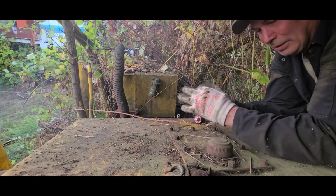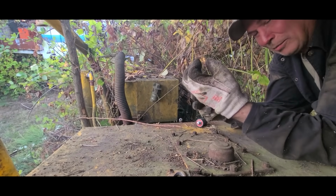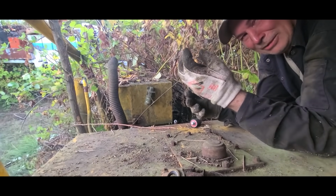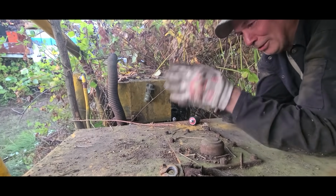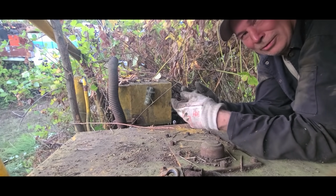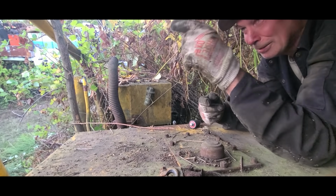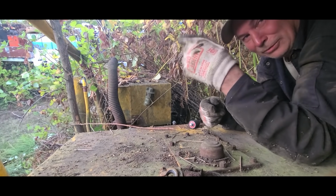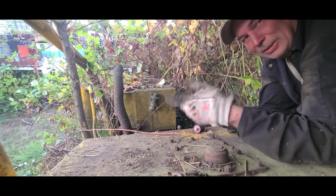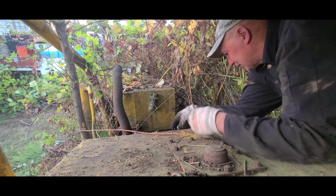Well, I like Series 60. You leave them sitting in a wrecking yard, and the carbon on the valve will kind of grow little hairy things. As soon as you turn the motor over, it falls onto the seat. Then when you go to start it, there's nothing. You can spin it and there's nobody home. The only way you get them to run is hose them down with a little bit of ether. You get one cylinder pickup and then it'll carry the rest of them. But that's how that works.